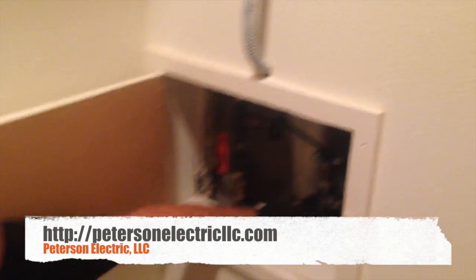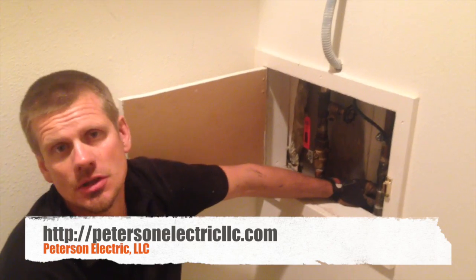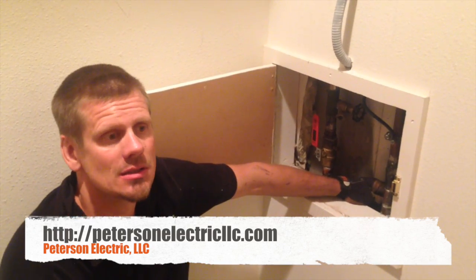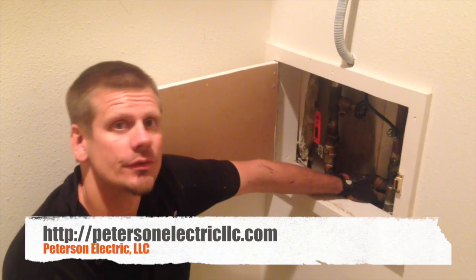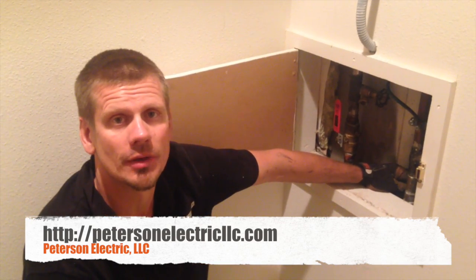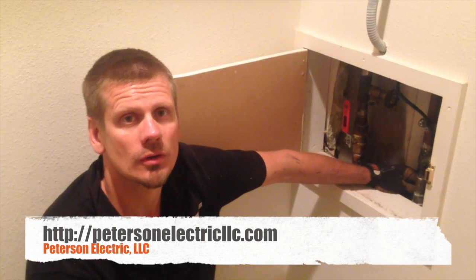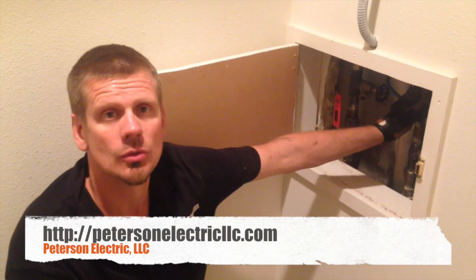A lot of people say, well, why is that? That's because of lightning strikes — and that's also the ground rods. But the second reason is if that transformer faults and shunts backwards, and the breaker doesn't take it as much as a buffer on that, the fault current goes past the 10,000 AIC fault current.